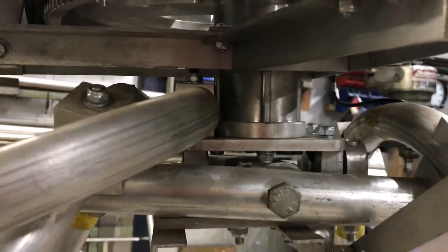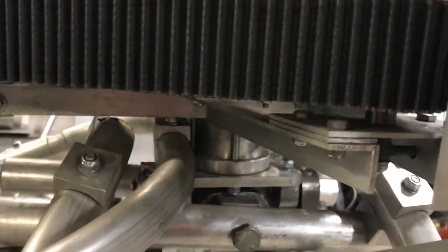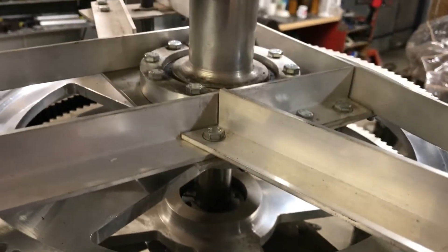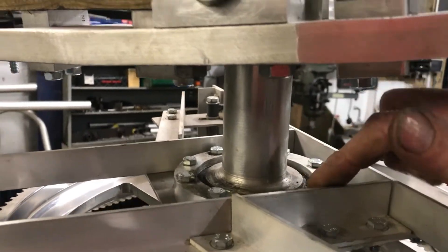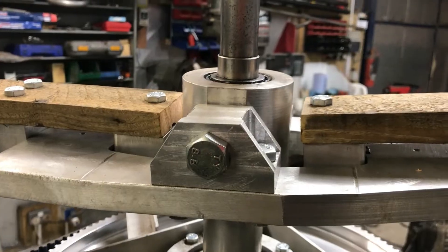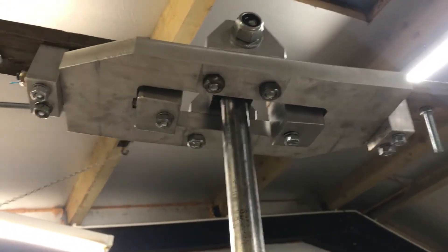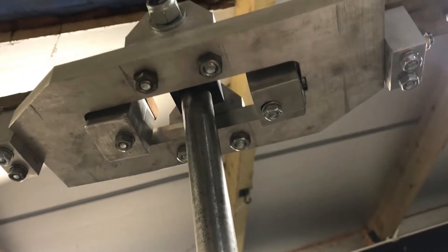The drive shaft goes right through the middle of this housing. There's a nut inside with two taper roller bearings pulled together by the nut on the shaft. There's a taper lock bushing on the bottom pulley which still allows it to rotate. The shaft goes up through this housing with another supporting bearing and a taper roller bearing at the top, taking all the load from the bottom rotor. The shaft continues up to the second rotor head, with the bottom taper rollers taking the force for that as well. The square section at the top is heat-shrunk onto the shaft with a bolt going right through.